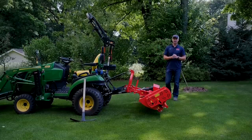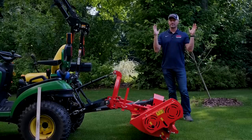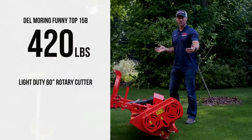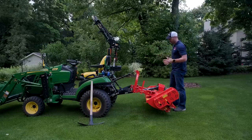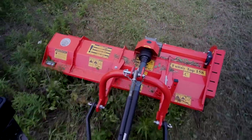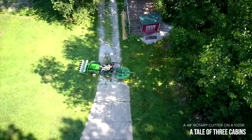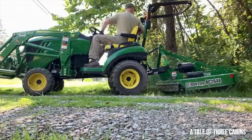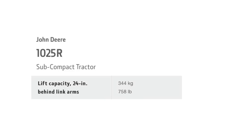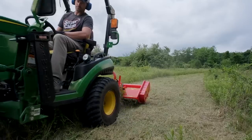The main reason I'd run a 60-inch flail mower but only a 48-inch brush hog comes down to attachment weight and the position of that weight. Using round numbers: a 60-inch flail mower weighs about 420 pounds, while a 60-inch rotary cutter weighs about 600 pounds — about 50 percent more. But you can also see how close the flail mower sits to the three-point hitch. That keeps everything compact, right up tight, where the tractor has more lift capacity. With a brush hog, you're typically about seven feet out from the connection point to the trailing wheel, which really diminishes the effective lift rating.